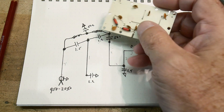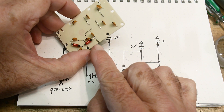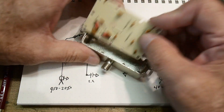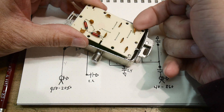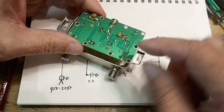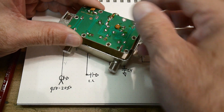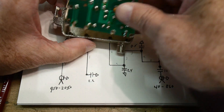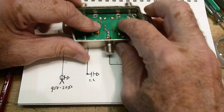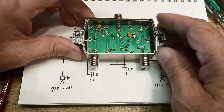Before we go, there was one other thing I learned taking this apart — you always learn something taking things apart — and that is how this PC board was mounted. There's a notch here, a notch here, and a notch here. Normally if the connectors were laying on top you'd just put it in like this, but on a single-sided board if you solder them down there's no way to get it out. So these slots allow you to insert it so the pins of the connectors go through the slots, and then once it's in there you can solder them down. That was a clever idea — I might have to use it sometime.